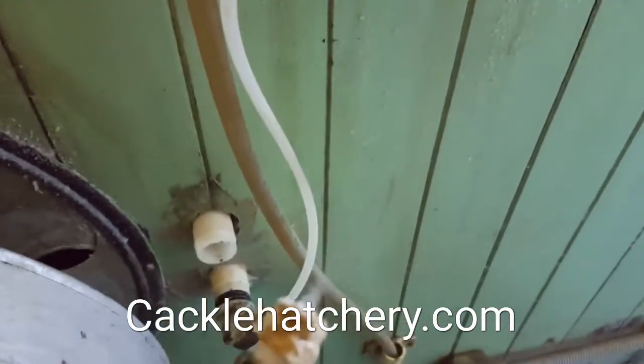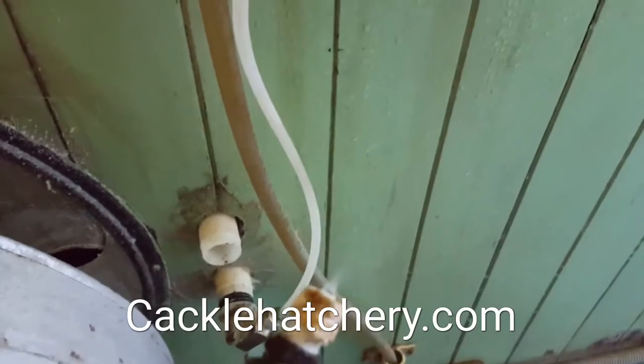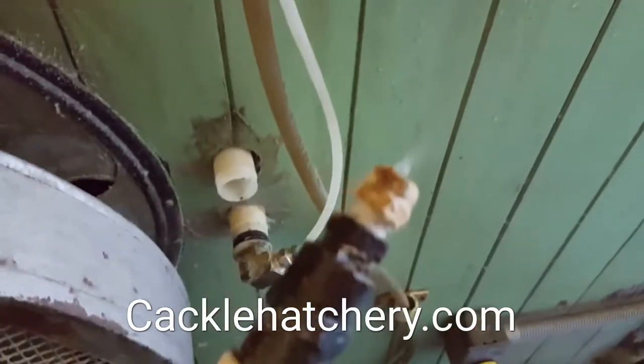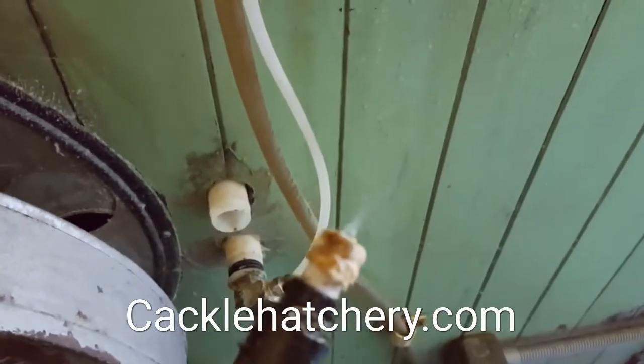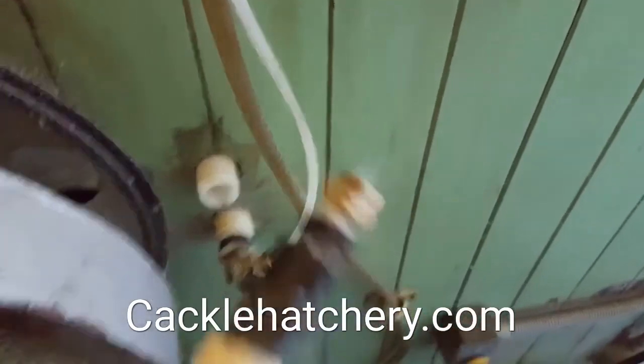Here's the primary humidity function, and generally this is off — it's not supposed to be spraying any water unless it's calling for humidity. But here it's just continually leaking, so the solenoid valve isn't able to shut it off.